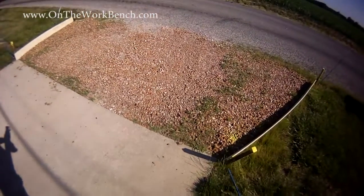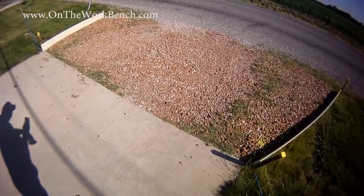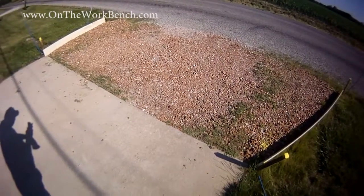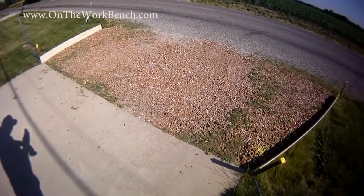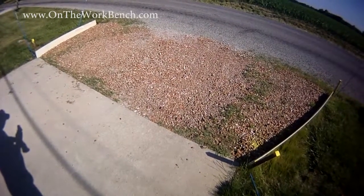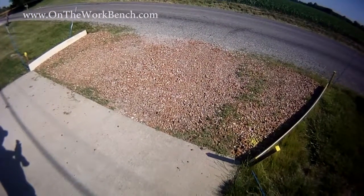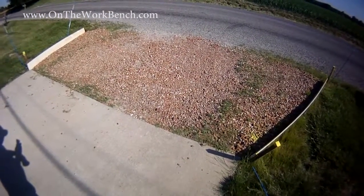All right, so I got my formwork set up here for my curb returns. I went ahead and spread out my aggregate. I've got it as leveled out as close as I can. Probably need to do a little bit more fill over on the left side of the camera. Do that with the rake. And then we'll start putting down the Bullcrete. We got a plate compactor to come out here and make sure this is nice and flat and even. And we use the Bullcrete here to get our surface.